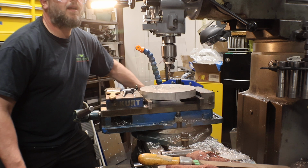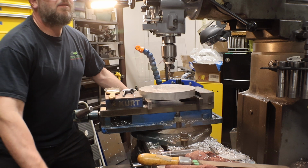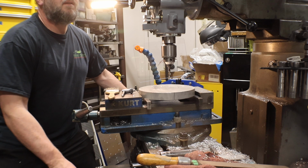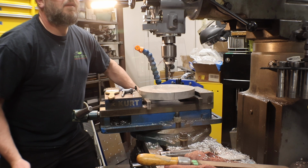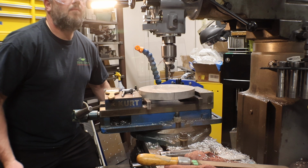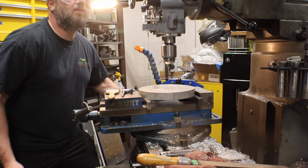Now, sometimes you kind of engineer a part on the fly while you're in the middle of making it. So being able to tack things together with some readily available bolts and not have to have tons of inventory, but a few of each thread type, and then confirm that all goes together. Then you go to the store and you buy the appropriate amount, or if you need a lot, then you buy a box of it.